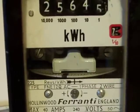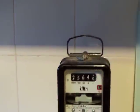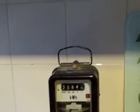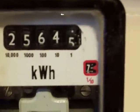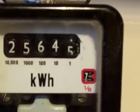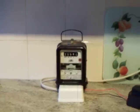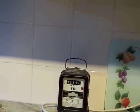There we go — let me zoom back out. I've stopped it there before the kettle boils because I'm just winding that reading up to point seven. There it is — bang on point seven. The reason I need it to be bang on point seven is because I've yet to do an accuracy test on this electricity meter, just to make sure the load wheel is going round at the correct speed.